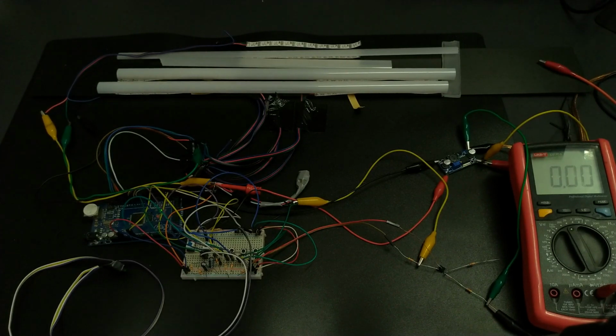The reason that I said 6.2 is because every chip for step-down converters has an internal voltage reference, in this case 1.2 volts. And the input voltage must be higher than the output voltage by the reference voltage. So, if I want 5 volts, I must provide a minimum of 6.2 volts at the input. And I think this voltage is always specified in the datasheet.